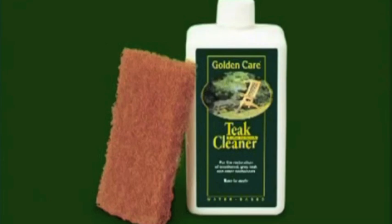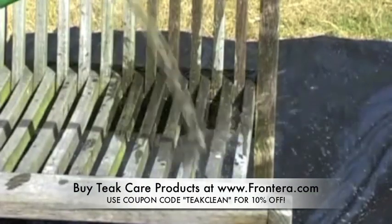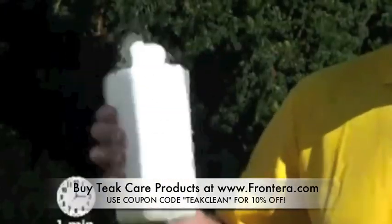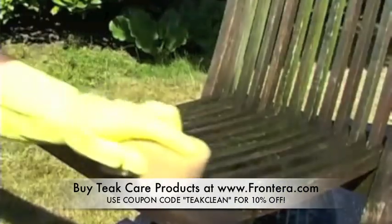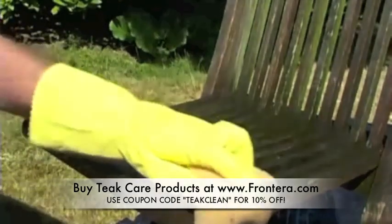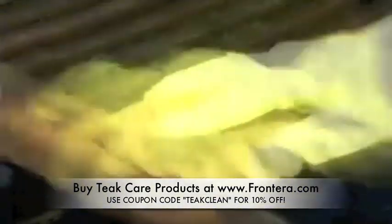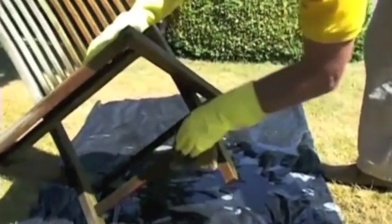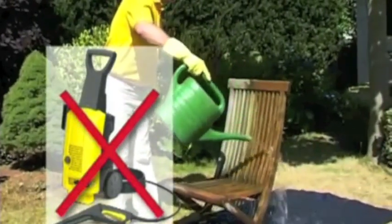With teak cleaner and a few hours of industrious work, your garden furniture will look like new again. Wet the teak furniture thoroughly with water. Shake the teak cleaner bottle briefly before use. Apply the cleaner to the teak with a sponge or cloth and allow the cleaner to penetrate for 3 minutes. Rub the teak clean using a scouring pad, doing this in the direction of the grain and using extra water if necessary. Rinse the piece of furniture thoroughly with plenty of water — the best way to do this is using a sponge or a hose. Do not use a high pressure spray as this will cause the teak to feel rough.